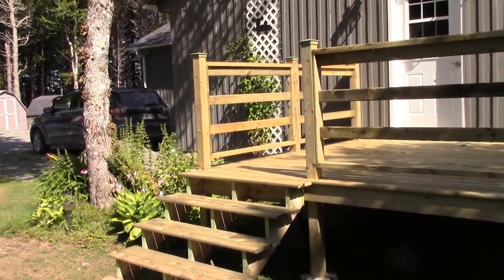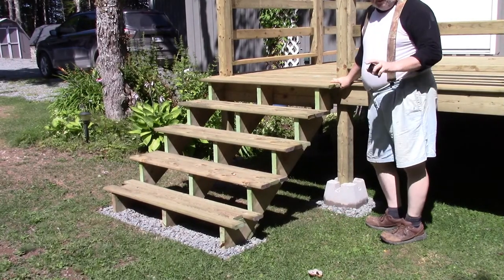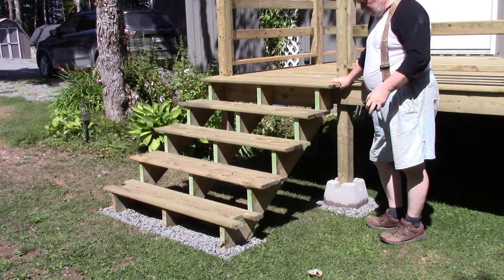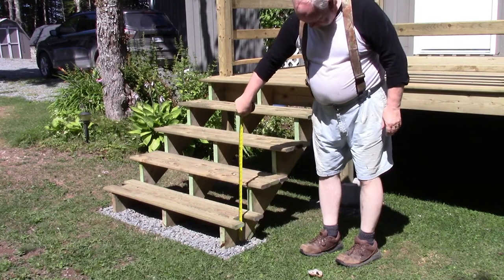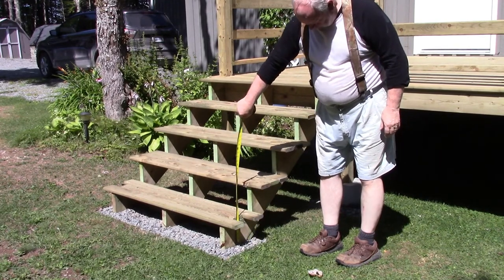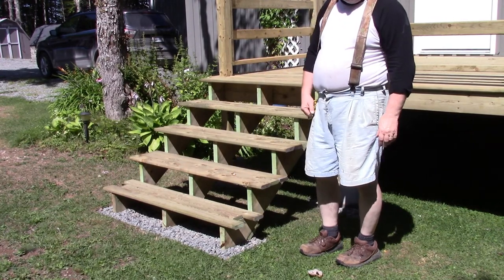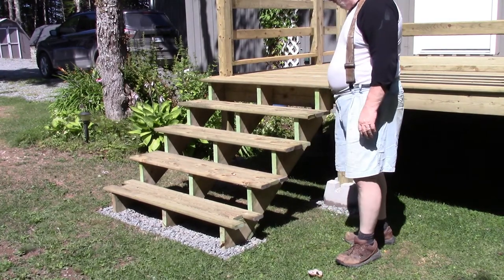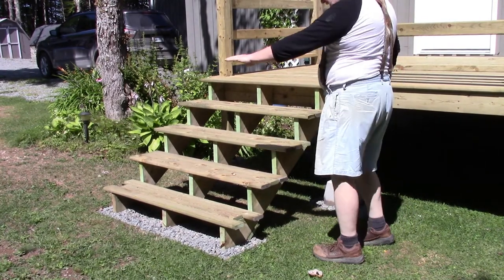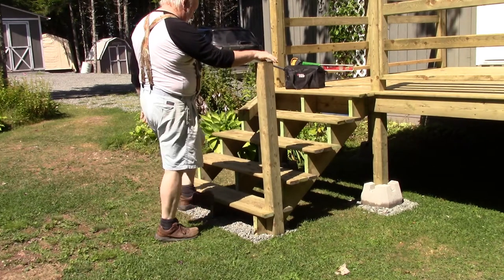So, next up on the agenda, lay out the railings. Since I have a piece of 4x4 that's 8 feet long, I'm just going to cut it in half, set it in here, because that's about 7 inches there. So if I set that here on grade, 7 inches till it gets level with the stair tread, plus 42 inches, that's 49 inches. The pieces I have will be 48 when I cut them in half, so I guess my post is going to have to be 4 feet tall. So here's my post, 48 inches tall. It would be almost that high.